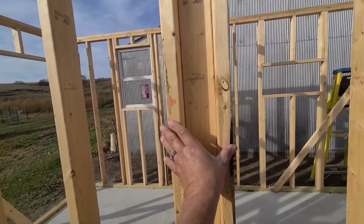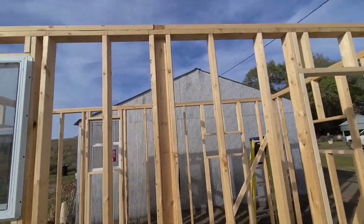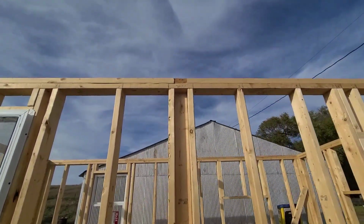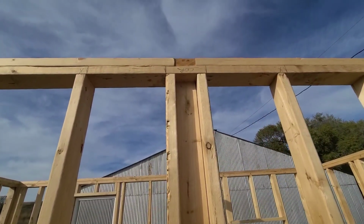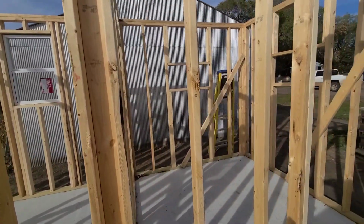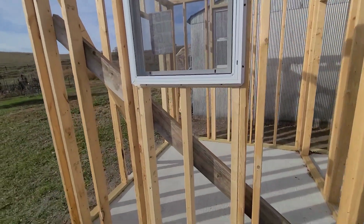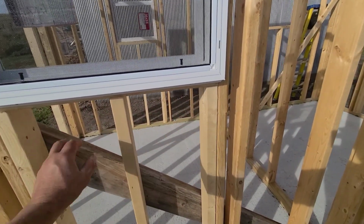It's like a corner channel type thing, and then 2 for the end wall. And right in the center of this wall, you can see how we marked it. We just laid it out for this corner and nailed that in. The rest of it just got regular studs. After we stood the wall up, that's when I framed all the windows and such.